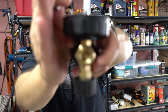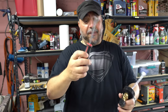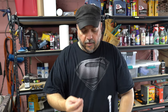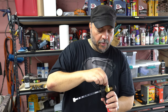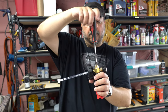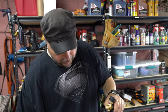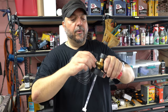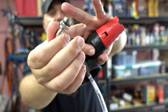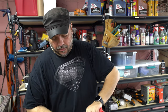And you're gonna see it's right inside there. Focus, you're gonna see it there. So you're gonna need a flathead screwdriver, get inside. All right, I got it out. We'll grab this one here. This one's a 1.1 millimeter orifice. Pop it in, grab my screwdriver, tighten it down, and you don't want it too tight, just enough. Got it tightened down. Now I'm gonna grab the 1/4 inch quick connect, and you can see it does have an O-ring on there. You know, for protection for water so it doesn't come out, because you are applying PSI pressure with this, with the pressure washer.